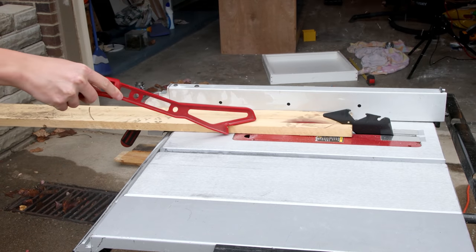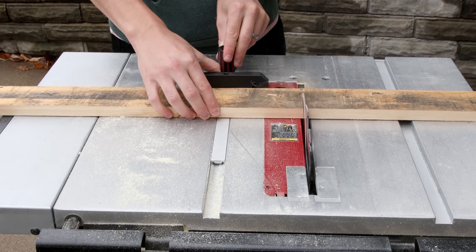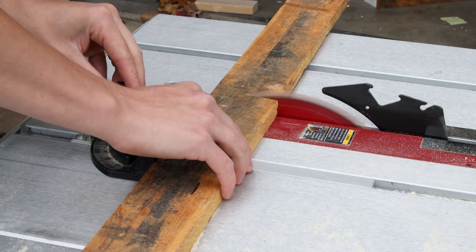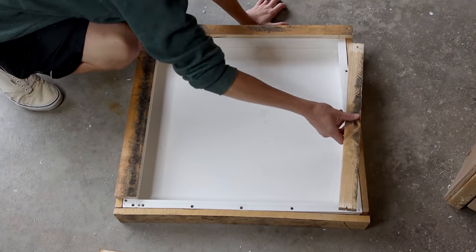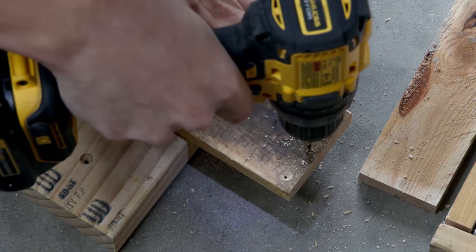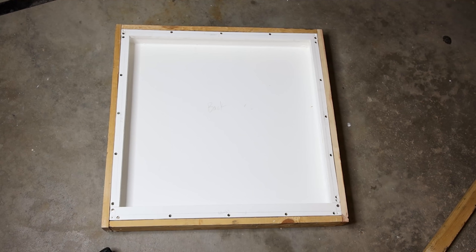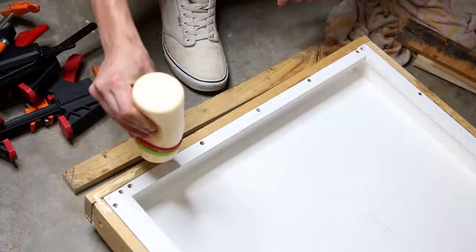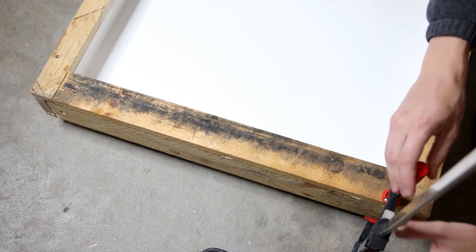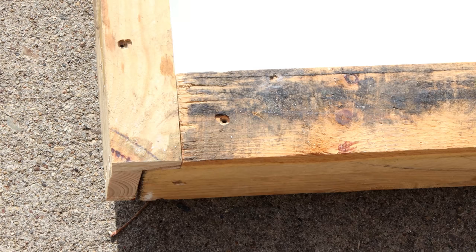I went on to rip all of the boards on the table saw. Once I had strips of wood, I went back and cut them down to the appropriate lengths. When making all of these cuts, I had to account for the added thickness of the wood around the PVC structure, so in most cases these measurements are an inch longer than the respective PVC pieces. After all of that, I had a series of boards that fit snugly around the PVC structure. Once I knew they would fit well, I drilled holes with the countersink like before. Usually I'd glue something like this together, but since the boards already look rustic, I figured exposed screws would complement the look — plus these are only visible from the sides. From there, I went on to glue the other pieces to the front in sections, applying glue, situating the boards, and clamping them down while the glue dried. After repeating the process a few times, I removed the clamps to reveal the final structure. The wooden box fits tightly around the PVC and doesn't need to be physically attached.